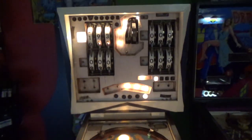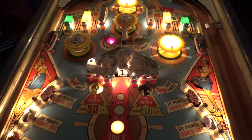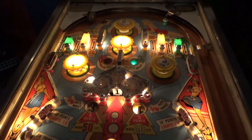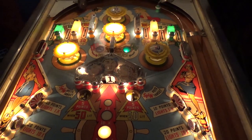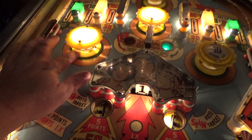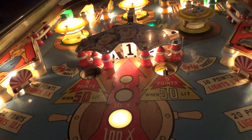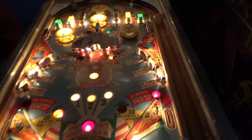Very cool. Now, we haven't done the backlight. Look, folks, it takes a while to do this stuff. We kept running into problems. We had to figure out why the pop bumper thing wasn't right. Then we had to figure out the swinging target thing. We had to clean all that stuff underneath the playfield. We had to fix the left pop bumper light, and we had to fix the roto target. We're getting there. It takes a while if you're going to do it right.